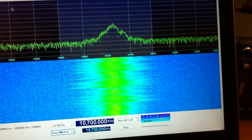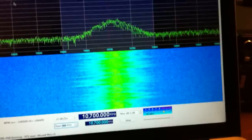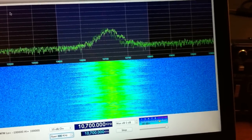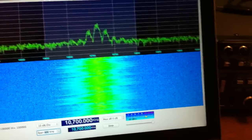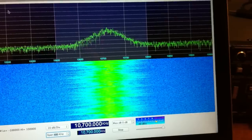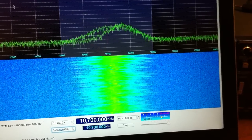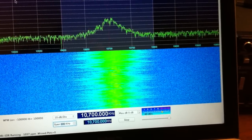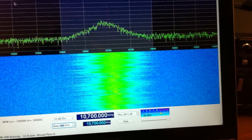So this is the setup. I'm actually demodulating wideband FM, downconverted from 91 MHz to 10.7 MHz, and my hope is that this will work equally well from 1.42 GHz down to baseband level. I'll hopefully be able in time to see a nice hydrogen line spectrum on my computer like this as well.